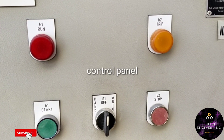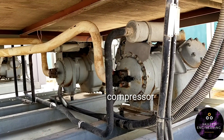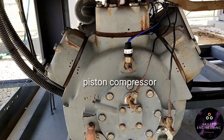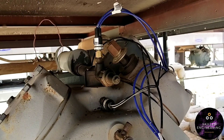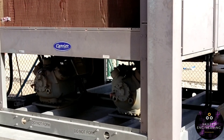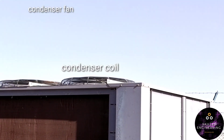This valve has a new control for the AHU and is used in auto or hand mode. This is the compressor of the outdoor unit. This compressor is a piston type — you can see the cylinder head and the sensors for the high pressure and low pressure switches. You can also see the condenser coil, and at the top there is a condenser fan.